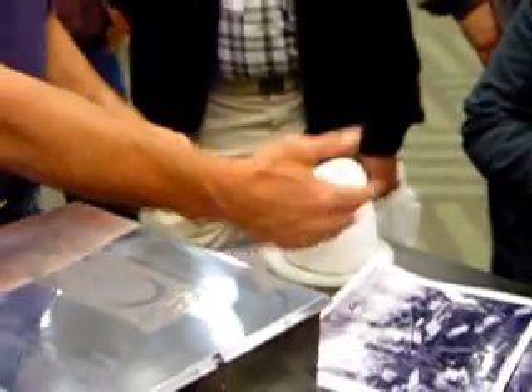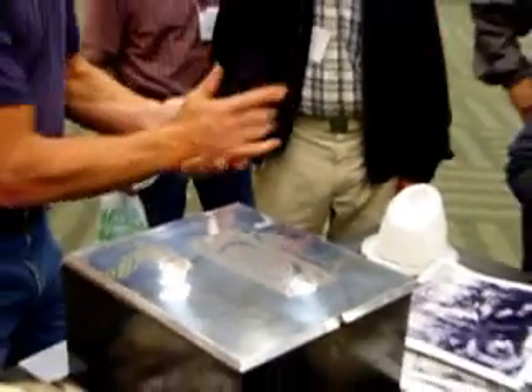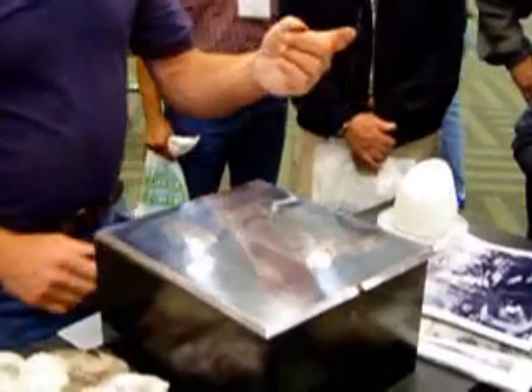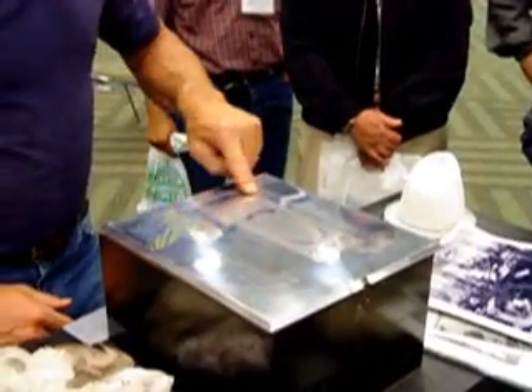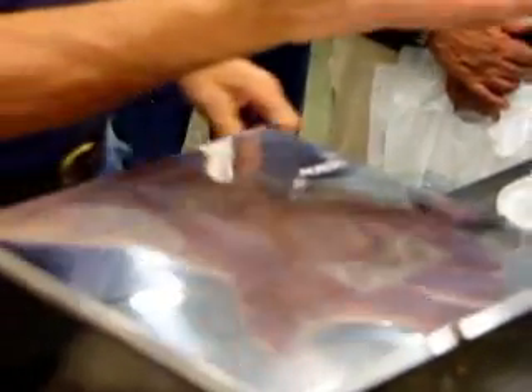See this guy right here? You know what that is? That's a ball of chalk — same thing as that. What that does is seal the moisture in my hand away from the plate, because if you didn't have chalk on there, you could take your finger and wipe that engraving right out. On the other hand, it's going to let me slide right across the top. As that chalk wears off, it's helping me clean and polish this plate at the same time, leaving the ink inside the engraved lines.